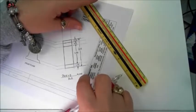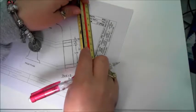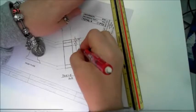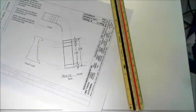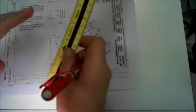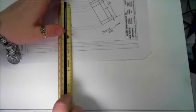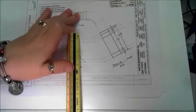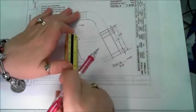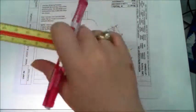When I'm doing my true size here on the auxiliary, my true length I see here, actually I think it was 2.1. Now I want to come over here and measure, because this is where you're going to start to see why it is important to do auxiliary views. I take that same scale and measure as if I was dimensioning this. When I dimension it in that front view here, it's only showing up as 2. Oh, no, that one is 2. This one is, there it is.